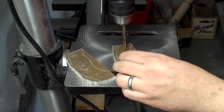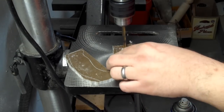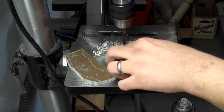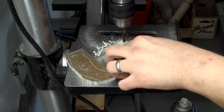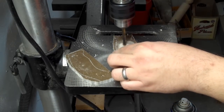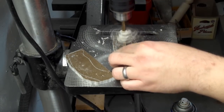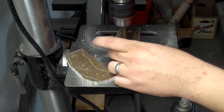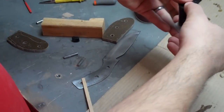For the pin holes, this part is not difficult at all. I used one of my dead drill bits to center on the quarter-inch hole in the knife and then made three easy holes on the drill press. At any stage of this process when I'm cutting or manipulating the fiberglass, I'm wearing a respirator because the dust and shavings are not something you want to be breathing.